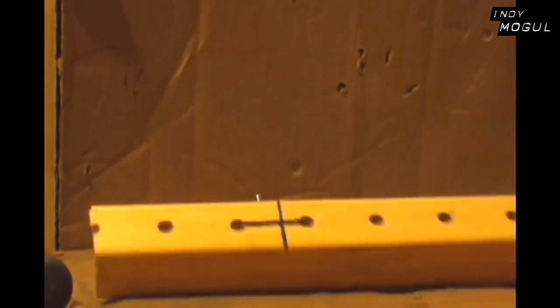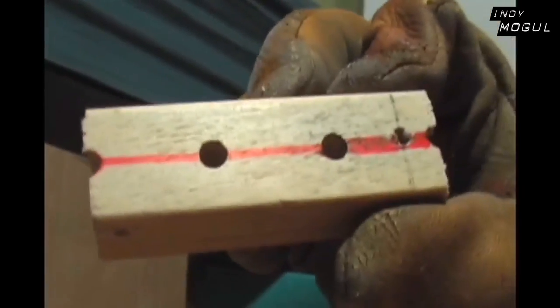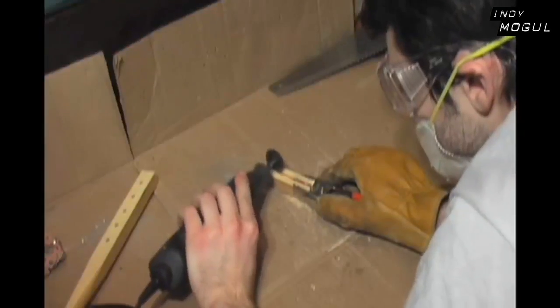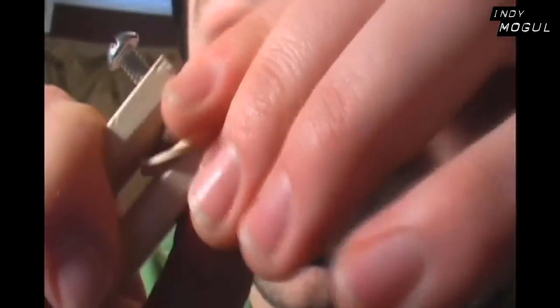Mark about three inches into the top of your wood and drill a hole straight through the center which your inch long screw can be threaded through. Drill a similar hole through the side as close to the top and front as possible. Remove any excess wood from at least a quarter of an inch behind your top hole and mark a lengthwise line across the top of your wood. Cut along your line through the wood, stopping a quarter of an inch before your hole. Using a coarse grit, sand down the inside of your cut and any rough edges until your two prongs are wide enough to let a screw and rubber band pass through easily. Loop one side of your rubber band around the side screw between your two prongs and the other side around your notch screw.